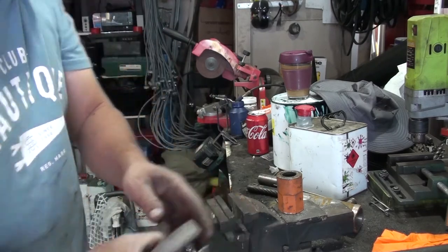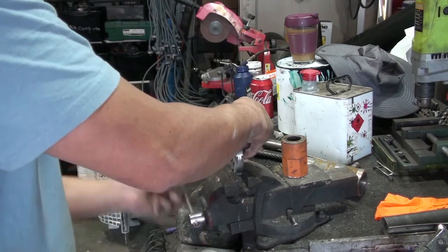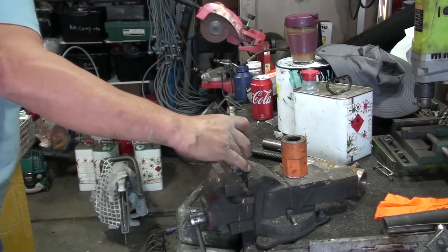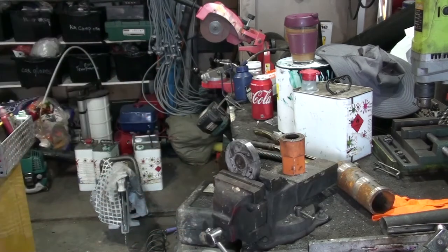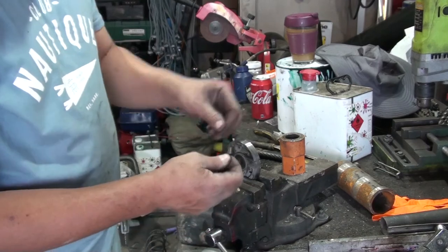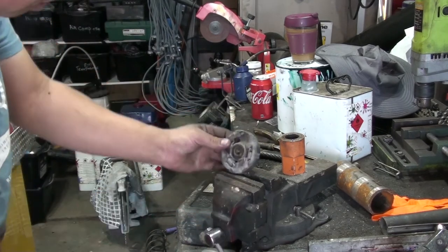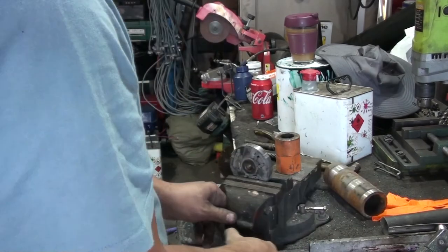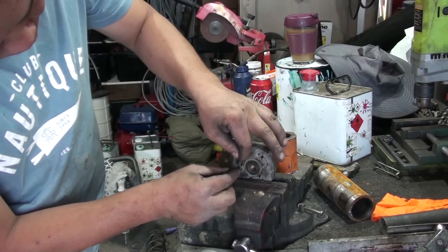Now in here, beautiful. The clutch spring. See, only one is broken. We're going to take one out and replace the other one. Okay, undo this bit and you can turn all the way there. Take it out. It comes up now, see? Easy way to put the spring back on. So this is the genuine Husqvarna spring. They cost roughly about $10. Can you see, guys? See that hole there? That's how this one lays, see the curve? It has to be laid out exactly the same.